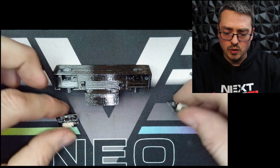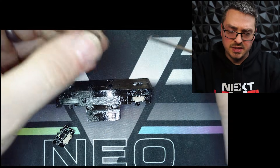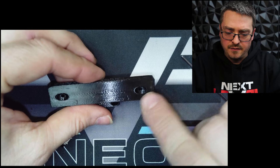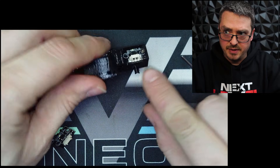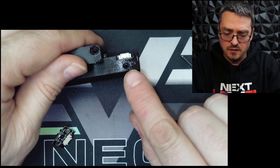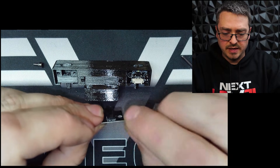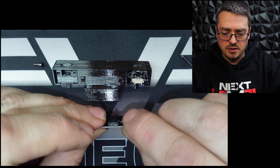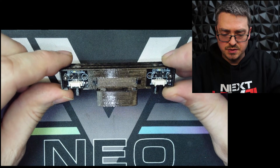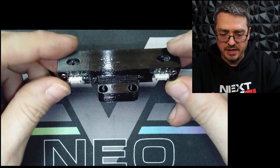Now we can move on to our 3D-printed part. We're just going to be putting these directly in — they'll slide right in place like that. We'll use that same screw and install it on the side just like the other one was. The filament is just going to feed through the top right here and out through the bottom. That sensor is right around both sides of this feed tube, so it'll put the filament directly through the brake sensor rather than using that lever. Just like that, we have both screws and both sensors in place. Make sure that they are flush.